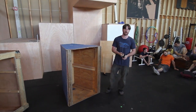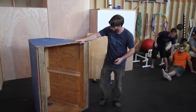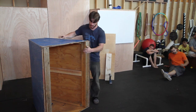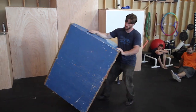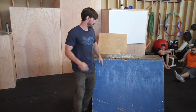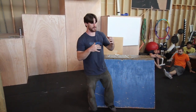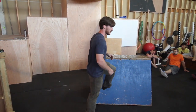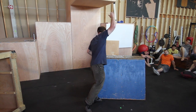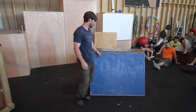You're also going to need quality materials — if the materials aren't very good they're going to break down as well. This box has gotten broken down quite a bit. I think this one is made entirely of half-inch plywood sheets, except for the top which we replaced. The problem is that the thinner you go, the more flex your material has. The more flex it has, the more force it puts on the things holding it together and the more risk you have of blowing through it. Which is what happened to the top — I blew through it doing a drop precision, hit the top, sides went, top cracked.